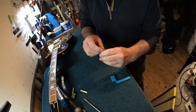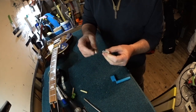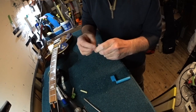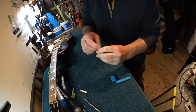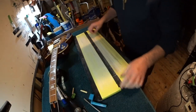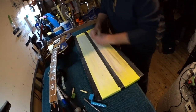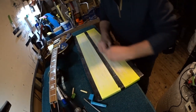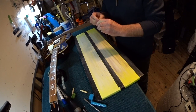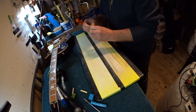Right. Yeah, it looks as good either way, funnily enough. Except I can see it's not 100% perpendicular yet, so a bit fiddly and all of that, but it's worth it in the end. Right, so we've got a bit of material to take down on the front here, and we want half a mil off if we can do it. I'm going to take it off the front edge, tilting it forward, and then aiming to level it perpendicularly. And we want it running in line with the top of the unit. So it's looking okay.